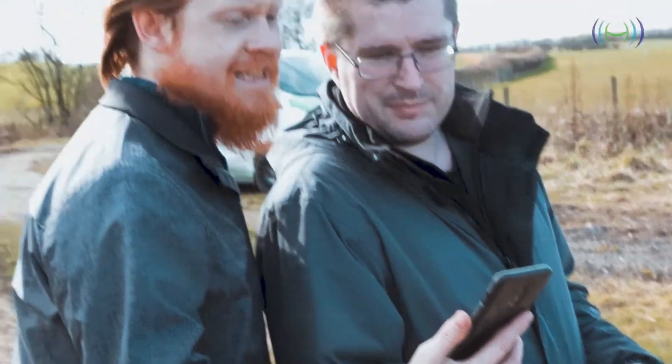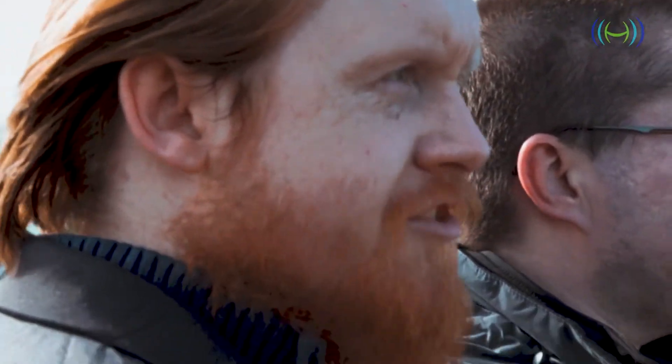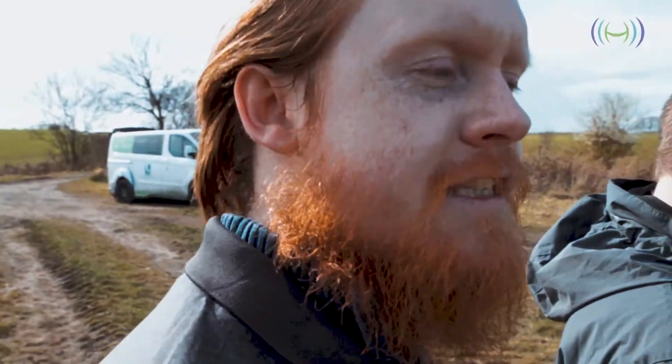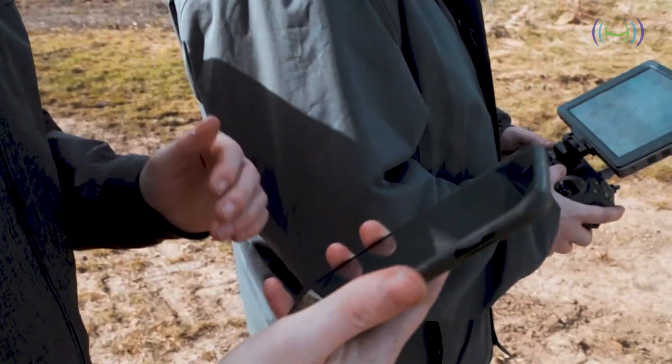Power draw is sitting healthy at 640 watts and spiking at 700. Kevin is doing some height tests, staggering at 10 meters per test — so 10, 20, 30 — in order to test the power draw of the drone with the tether. We're currently sat at 50 meters and drawing 820 watts from the drone.